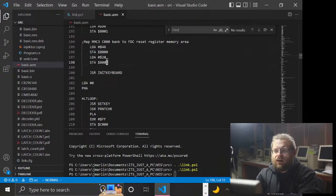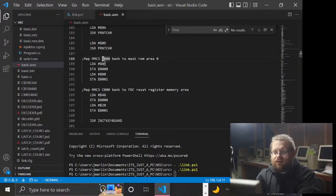So these registers, 8000 and 8001, are basically the two registers that allow you to configure the MMC. One lets you select what register you are mapping to, and a register corresponds to one of several blocks of memory that you can map. So there are three or four 8K windows that you can map to different areas on the other side of the MMC3. So this first one is selecting the register, and then this is writing the value into it. And we were already using this for 8000, like I said, is where the floppy is. And we set that mapping up to 00 because that works just fine. And we haven't had to worry about it too much, and that's the easiest one because the window sizes and whatnot don't matter, because zero times whatever is zero.